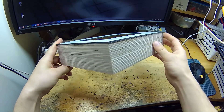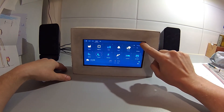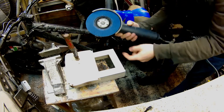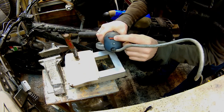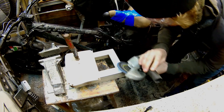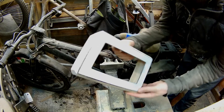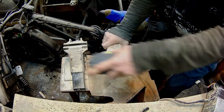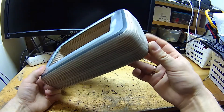And this is what I got. It looks kind of bulky, so let's make it look nicer by rounding the edges. I don't have a fancy belt sander, so I'm using a grinder with a flap wheel. The key here is to adjust the speed to the minimum, otherwise you're gonna burn the wood. So first I made a rough pass making a big bevel all around the edges, then I followed that with a lot of sanding. That took forever and I think I'm going to continue that a little bit more, but here is the result right now.